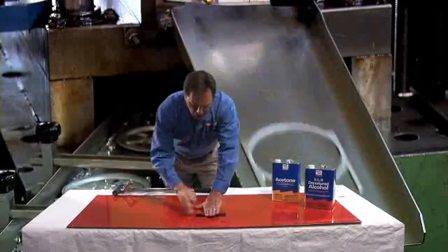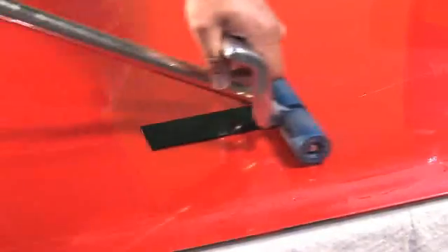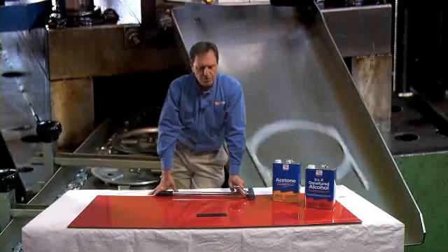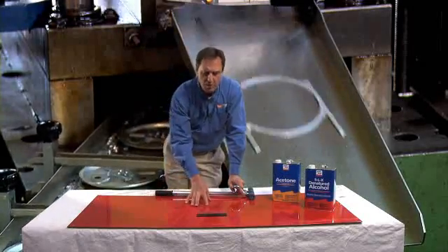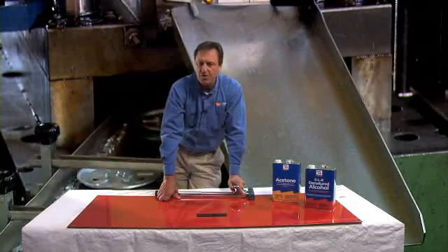This 1198 is a cross-linked rubber which has very high adhesion and very high shear strength. You can bond that down, and by using pressure we will literally double the bond strength — you can get these pressure sensitive systems to bond very well to powder coated surfaces. You do occasionally come across some powder coated surfaces that have somewhat of a slight texture, but even with the slight texture, the pressure sensitive systems are going to work for you.